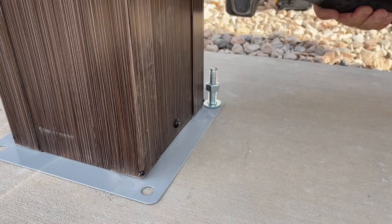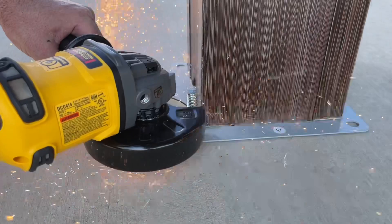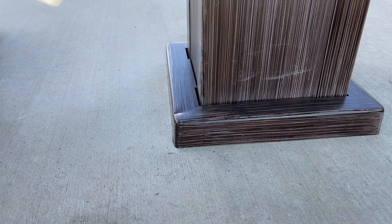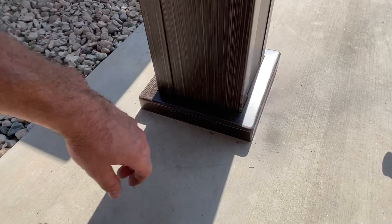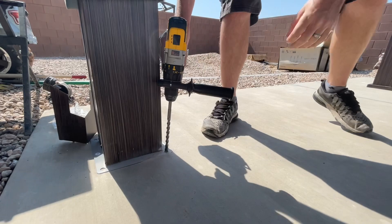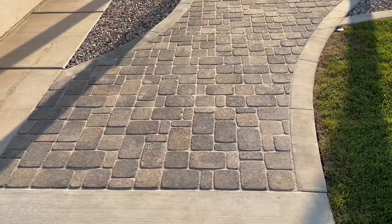You can see we can drive this down — as we do, it expands and firms it up. If you have to, you can use an angle grinder to cut off the excess, or if you mess up the threads or the bolt that's about your only other option, but be careful — it's super hot when you do that, so use pliers and don't ever touch it. One other note: as you're drilling, make sure you don't hit the rebar. If it's reinforced concrete you might start hitting rebar, and if it's not drilling like it should with powder coming up, you might be drilling into metal. Thanks for watching — please subscribe to the channel and I'll put a playlist in the description for other home DIY projects like this.